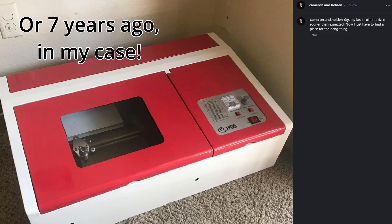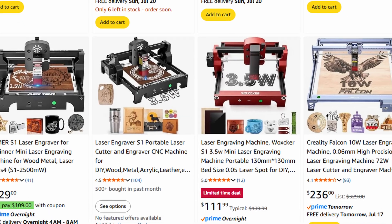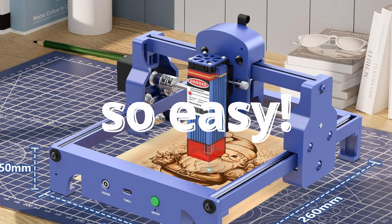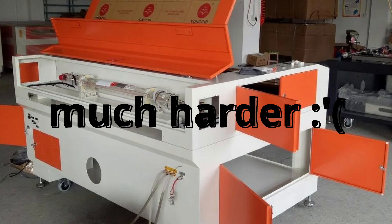Let's start with a quick overview of laser technology and why you might want a CO2 laser. A decade ago, a hobbyist purchasing a laser machine would likely be looking at CO2 lasers, but diode lasers have become a lot more powerful in recent years and they're a really good option. Most hobbyists seem to be going for diode lasers because they're often more affordable. The cost is lower because a diode laser machine is a lot easier to construct — you can just slap a diode laser module on a basic motion system, while CO2 laser tubes are large, require a system of mirrors to get the beam to the material, and need water cooling.